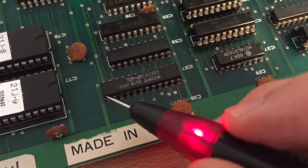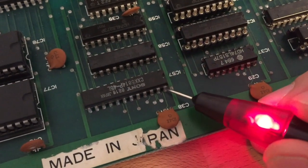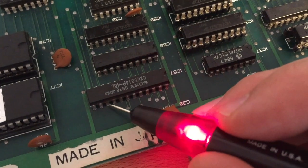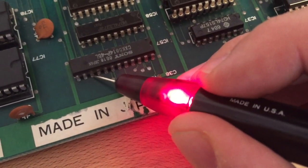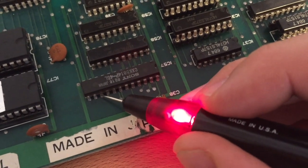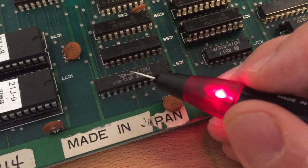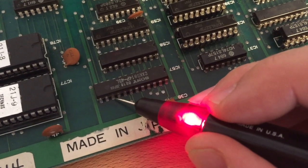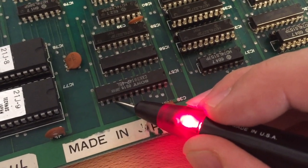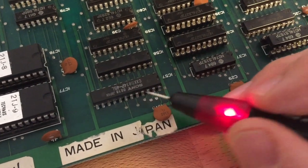need to be considered, but something funny shows if we look at the data line again. You see that it's not only high, like this line here, which is high, but also you see that there's this one over here, a small kind of wiggling in the signal going on. So I think that this signal cannot be really a steady high signal. So it looks to me as if the RAM chip itself would actually have to be compromised to output such a non-steady high signal,